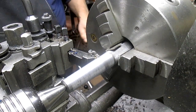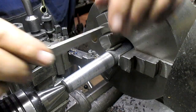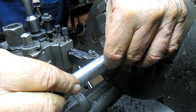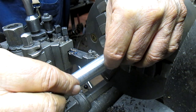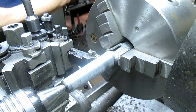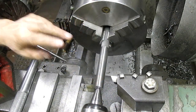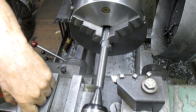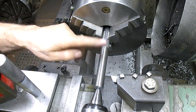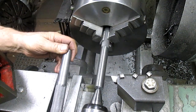Okay, well, we may have a problem here. As I'm going, I realize that, what's our distance? There's 3.5 right there. I realize that we're gonna have to bring this down pretty tight, and that center hole is not gonna be conducive to that. Let me go find the paperwork and I'll... Okay, well, we started again. Two reasons. I just picked up the piece of metal that was sitting next to the paperwork, and it calls for 3/4, and what do I cut? 1 inch. So now I've got a little tapered shaft of 1 inch.